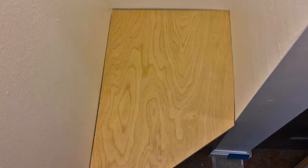There's almost always a little hollow in the middle of a short partition wall like this. It comes from the extra buildup of joint compound where the drywall tape and corner bead are. I would have been better off skimming this flat, but it would have taken a lot more time and a lot more mud.